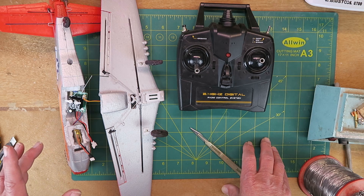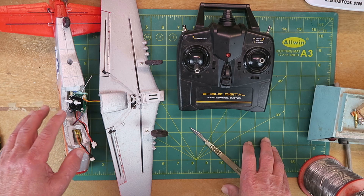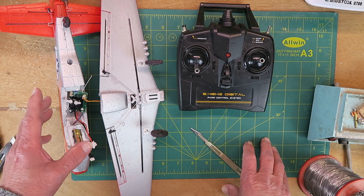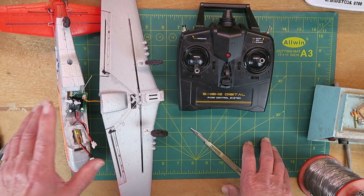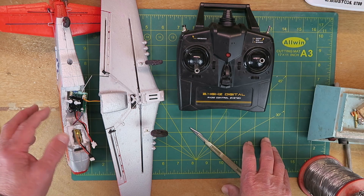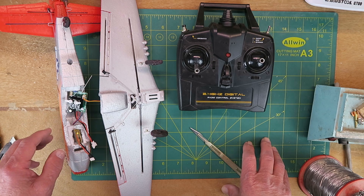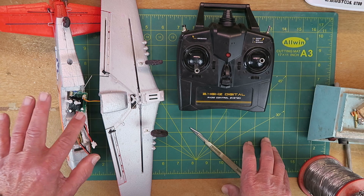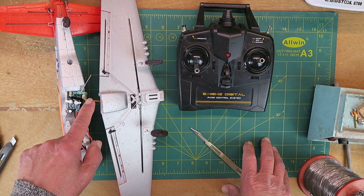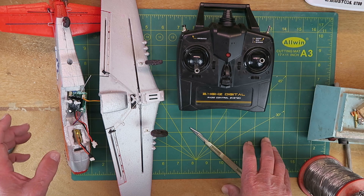What's happened in the end though is rather odd. It only seems to operate in three-channel mode. I was wrong in my initial statements that this controller is only used in the four-channel Warbird series and also on the Volantex Sport Cub. Thanks to my friend out there in Oz, it reminded me that it's also used in three-channel models. The way it supposedly switches between the two modes is sensing when the aileron servo is connected — a little odd, but that's apparently how it works.